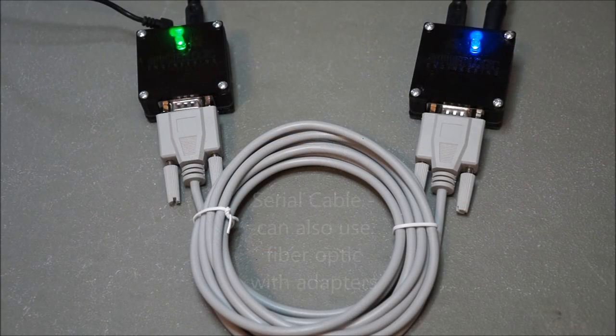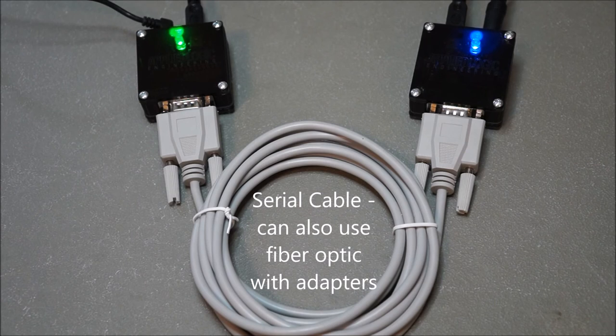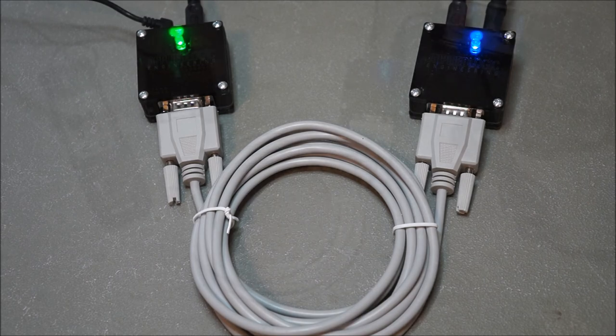The combination of the AL726 remote to serial adapter and the AL716 serial to LANC adapter allows you to separate the operation of the remote control from the camera by hundreds of feet, if not thousands of feet. By using serial adapters, you can also implement a fiber link and/or other serial types of links to increase the distance between the two adapters.